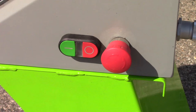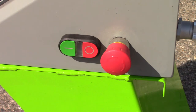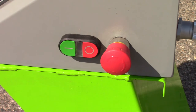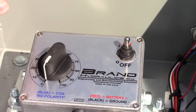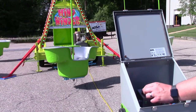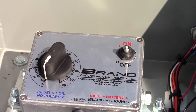On the side of the control console, you will see a red emergency stop button along with a pair of buttons — one red and the other green. The emergency stop button cuts all motor power to the ride. In order to release this, twist the button in the direction of the arrows and allow it to pop up, disengaging the emergency stop. The green button starts the motor and the red button turns off the motor. To start the ride, make sure the emergency stop button is released and the motor is on. Open the control console using a screwdriver to reveal the controls. To spin the ride, turn the on/off switch on and then slowly turn the dial until you have reached the desired speed, with the maximum speed being 100%. To stop the attraction, simply turn the switch off and turn the dial to zero. You do not need to turn the motor off in between rides.